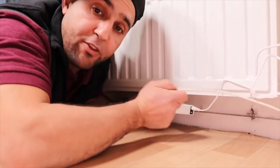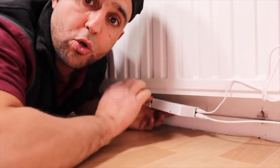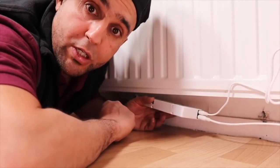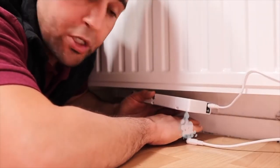This is the adapter — click. If you remove the temperature sensor, the fans will start immediately. If you connect it, they go out. This way you know that your sensor is working properly. The only thing I now have to check is that I have mounted my fans the right way so that they blow the air up. Feeling with my hand — yes, that is very good.